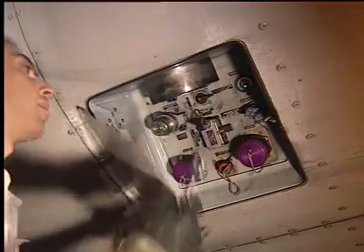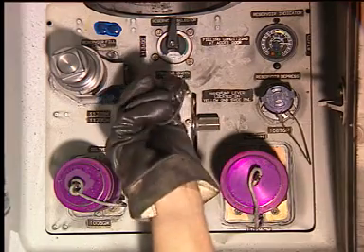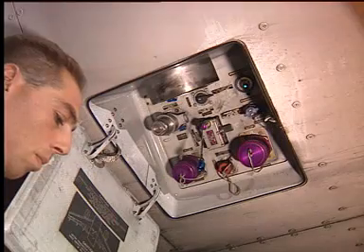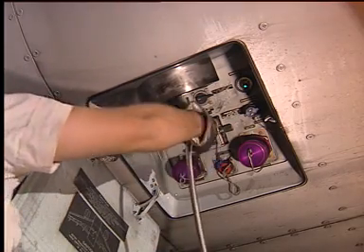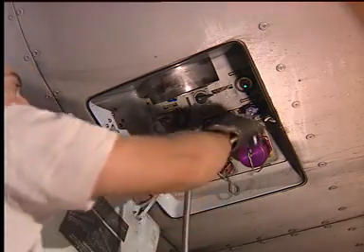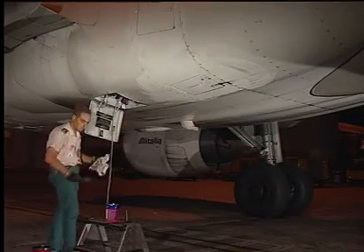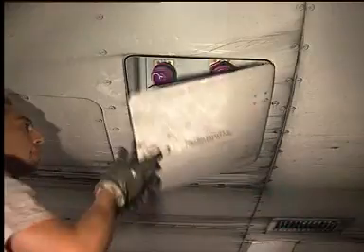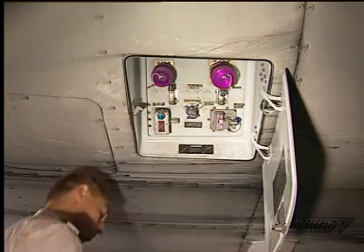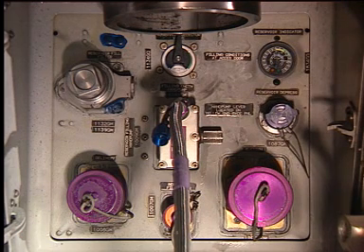Now, let's fill the blue system. Open the green service panel. Remove the cap and connect the flexible hose. Above the panel, you find the filling hose. Remove its cap, connect the filling hose to the fill valve. Go to the yellow service panel to take the handle and fit it to the refilling hand pump shaft. Notice that it is possible to fill any of the three hydraulic reservoirs from one place. It is also possible to fill the reservoir with a hydraulic service cart, connected here.